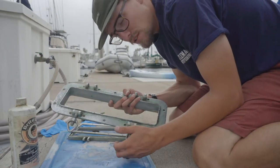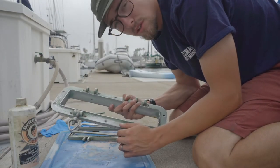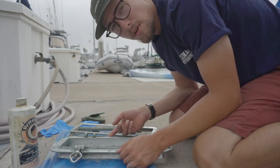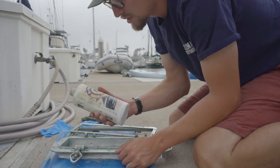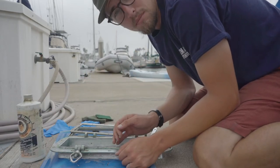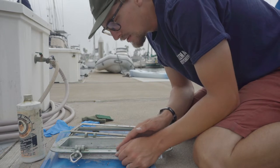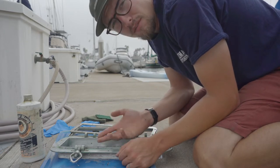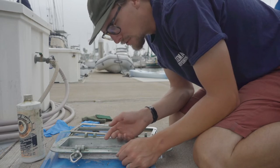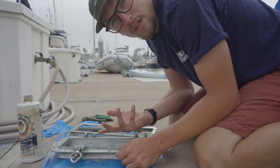We got our port lights off. As you can see, we got quite a bit of corrosion just over the last 35 to 40 years. So before I put it on the buffer, I'm using some Bright Boy and just a couple pieces of Scotch Brite — not very hard, just pretty lightly — getting the really big stuff off before I put it on the buffing wheel. Because if I put it on the buffing wheel now, it'll just chalk up and it won't work out very well.